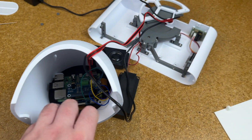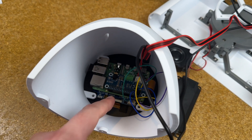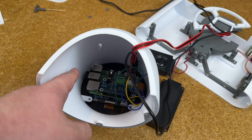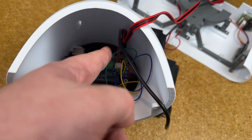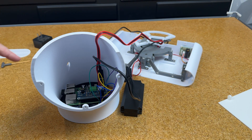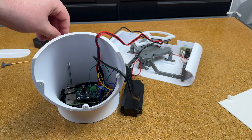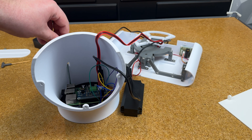It's got three screw holes and these are M4s. The rest of it's a smaller size, but this was just the screw hole that the display had, so I couldn't really do anything about that. It's got one up there, one here, one here. I didn't put one in the corner there because of the USB-C — it just wouldn't fit. I found that it was possible to get my hand all the way in to do the top one, but instead of having to deal with that I just put an access hole in so you can just get that in right there — though it is still difficult to actually finger thread these in.